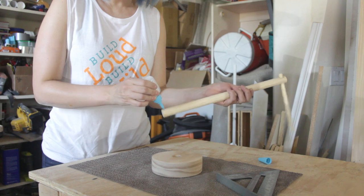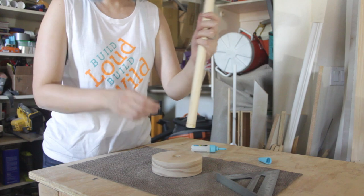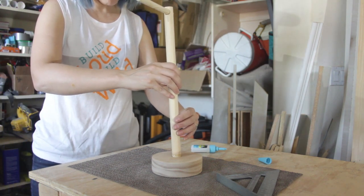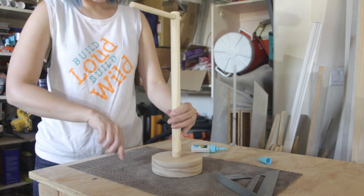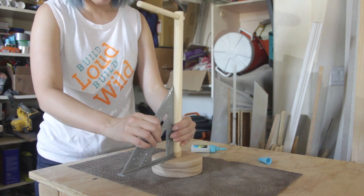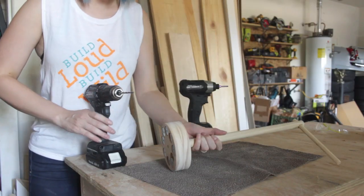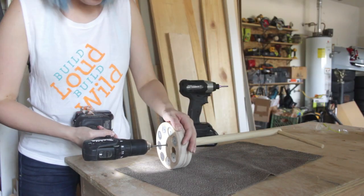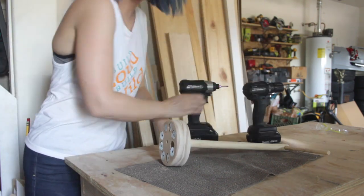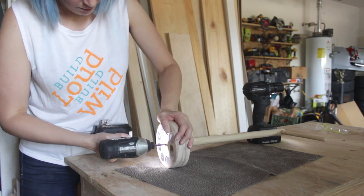When everything was fully dried I could add my vertical rod and cross arm. I added more of the quick-drying glue to the end of the dowel and pushed it in place. I then used a speed square on all sides to ensure that it was sitting vertically and checked from all angles to make sure it wasn't leaning. When the rod was fully dried and set in place I flipped the towel holder over and drilled a hole up through the center, then drove a number 8 two-inch wood screw up through the hole to secure the vertical rod tightly in place.